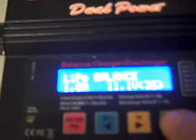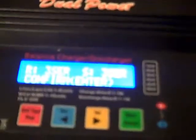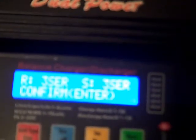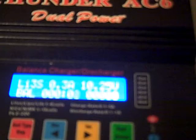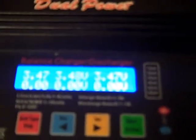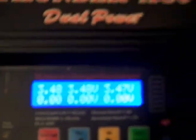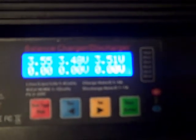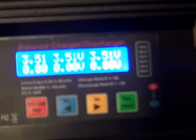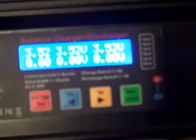With the battery connected in both the balance plug and the Deans connector, you push and hold the green button until it goes to battery check. It then says '3SER' for 3-cell and gives you either cancel to stop or confirm to enter. Hit the green button again and it starts charging. I then hit the yellow button to see the battery voltage — each cell is read out. These cells are all at 3.49 or 3.5 volts, and the battery starts to charge. You can monitor the voltage of each cell the whole time.